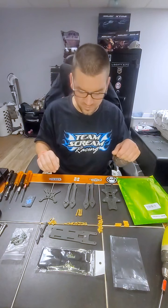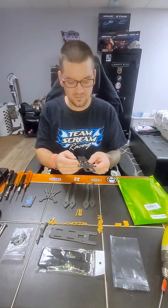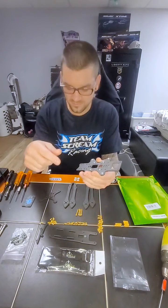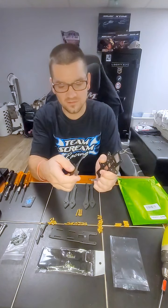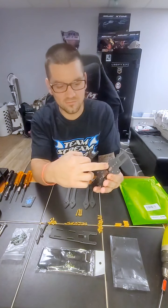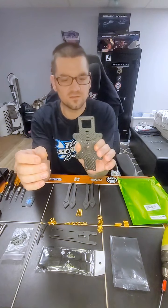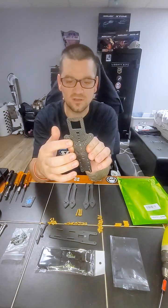Let's start off by putting this thing together. You're going to take your bottom plate right here, with your press nuts facing up. This little cutout right here is the front. And then you've got your sandwich piece right here. As you notice, there are grooves on one side of it only. These are going to go along with the 20x20 holes on the back here, just like that, so that if you do decide to use a 20x20 stack, you'll cut those off.